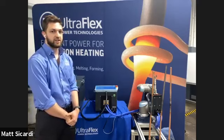And the part has reached brazing temperature again. It's going to back out, go to the second joint, and run the same exact cycle. So here again, we focused the induction coil over the copper because it's less efficiently heated. And as you see, once we bring it up to the steel, it gets red hot within a couple seconds.